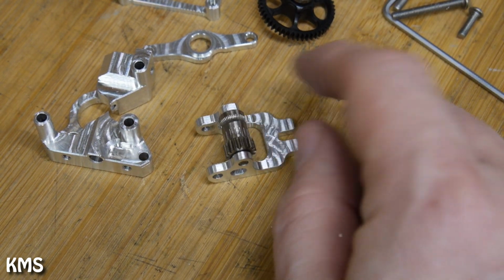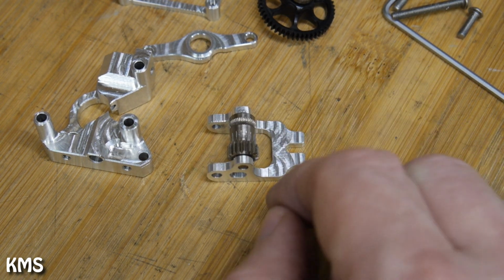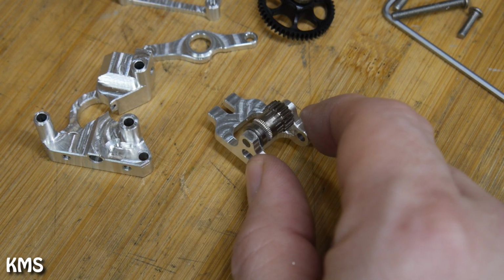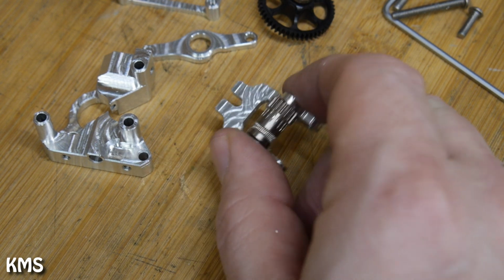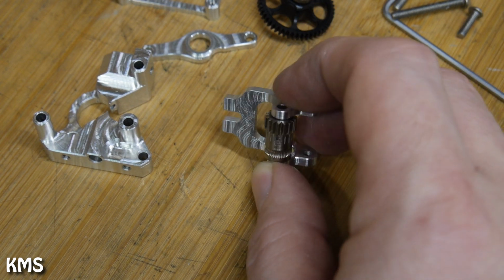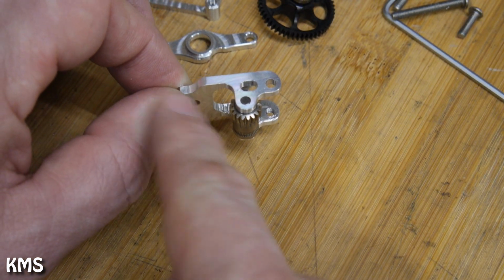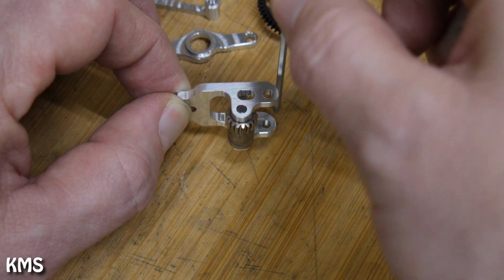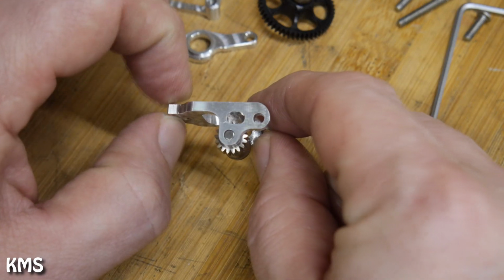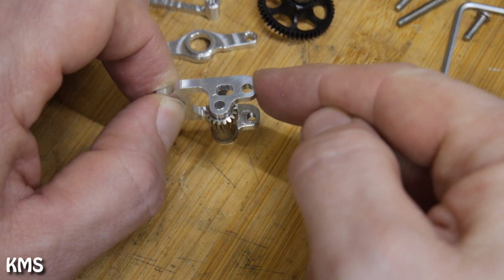The third part is the tension arm. In itself, it's not that hard. I made my life a bit more challenging here, because I wanted to do it on the 4th axis in a real one and done operation. In the end I succeeded, but in the process I killed an end mill, simply because I decided it would be a good idea to hold it like this, cut away everything, and then walk around with my end mill. It turns out that the 2 mm of aluminum back here is not strong enough to hold if I cut it with an end mill from here.